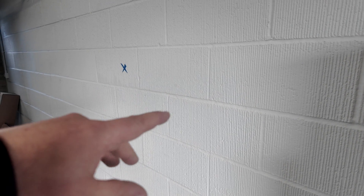Because we've got the gateway, it just comes off the RJ45 link over to the gateway. The gateway is going just the other side of this wall — x marks the spot — just in there under the stairs. This is a typical new build where we've got a switch fuse that feeds off via a steel wire armour to a consumer unit. We're going to position the gateway in there, and because there's existing PV on this one, we're going to use the smart port to take that PV input into the Sigenergy system so it can see and monitor it.